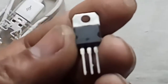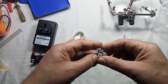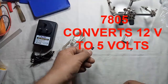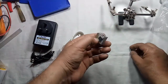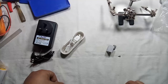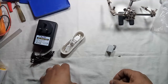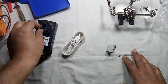The voltage regulator value is 7805. The main function of this voltage regulator is that it converts 12 volts to 5 volts. You will also need a heat sink to screw it and some wires. You can easily charge your power bank or smartphone in a rapid manner — it will take approximately 45 minutes to get fully charged.